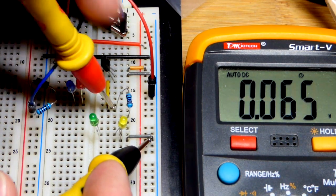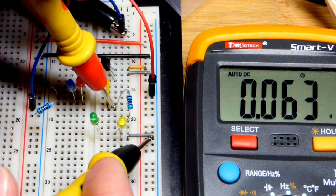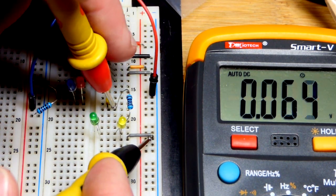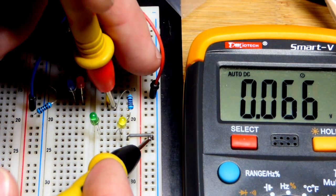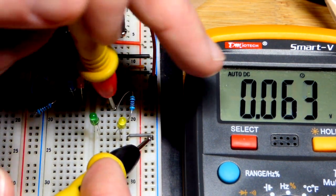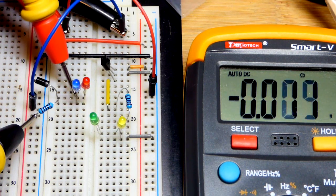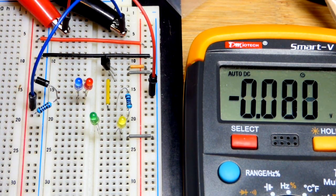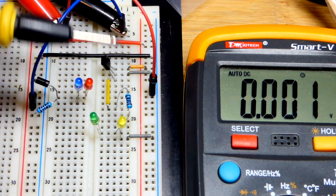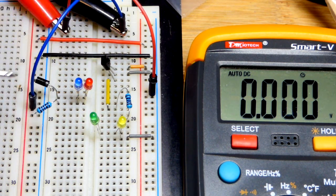There you can see that, oddly enough, even though the power supply voltage is reversed, we have a slight positive voltage there. And I think that's because the transistor is connected both to positive and negative. It's different gates, and the gate is actually more to the positive rail now, because the polarities are swapped. Somehow it's working out where we actually have the voltage we desire more, even though it's not enough to actually do anything. Whereas with this one, there's a negative voltage, which makes sense, because this side, the red probe, is more negative than that side. So even while it is blocking the voltage as a rectifier diode, we're using a MOSFET as a rectifier diode, basically. Even when it's blocking, it's doing a better job blocking.